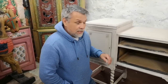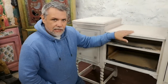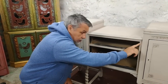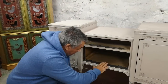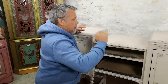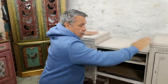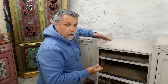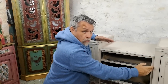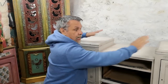Hello everyone. So this is one of those challenges that Mel gives me sometimes. I've had a look at this piece and it looks like this centrepiece here is separate from these two sides. There are some screws on the inside walls that attach the centrepiece. On the back, there's a single sheet that I'm going to probably have to take off and cut into three to make two back pieces. I'm going to take this over to the workshop, knock this piece out of the middle, take it all apart, and if I have to make a new inside wall, I will.